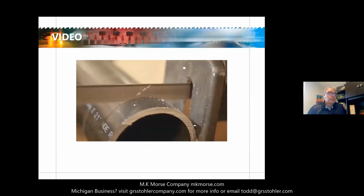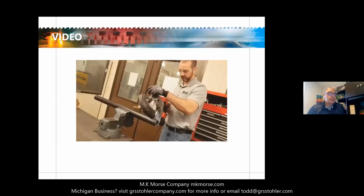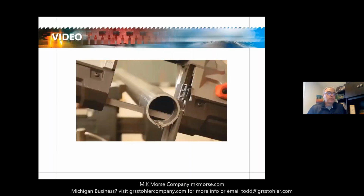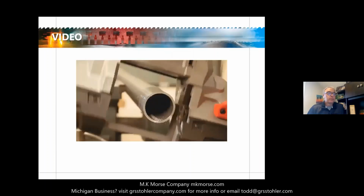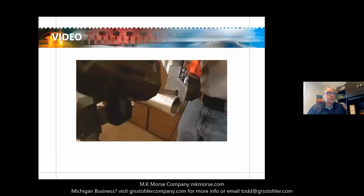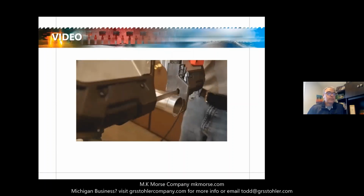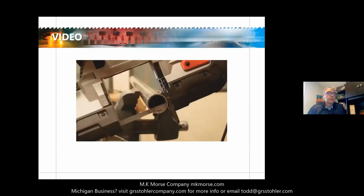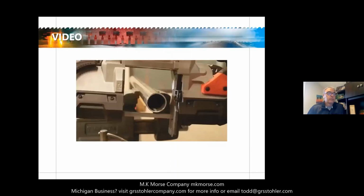The tooth of the 811 blade is designed with a large backer so that it withstands the impact of going in and out of materials. This makes it a much more durable and longer lasting blade. This is especially advantageous when cutting stainless steel, as the blade is always hitting a fresh spot of stainless as it is cutting. The 811 cuts fast and leaves behind a very clean, weldable finish.